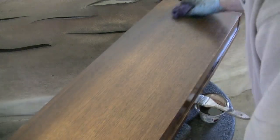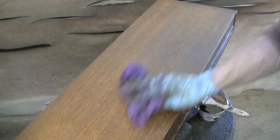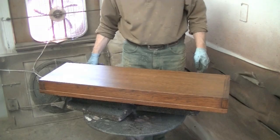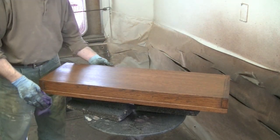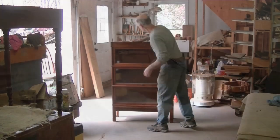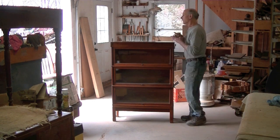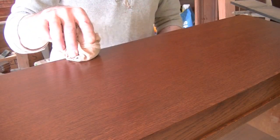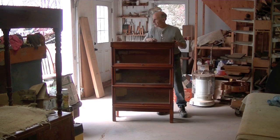This is great. I don't see any trace of the rings and water spots. There was a spot here that was the biggest ring and then a bunch of spots over here. I'll seal it with a coat of shellac and then give it a couple of coats of polyurethane in case somebody decides to put plants on this thing again. Here you're going to see the top all done with some finish on it — the spots are completely gone. It looks pretty good.